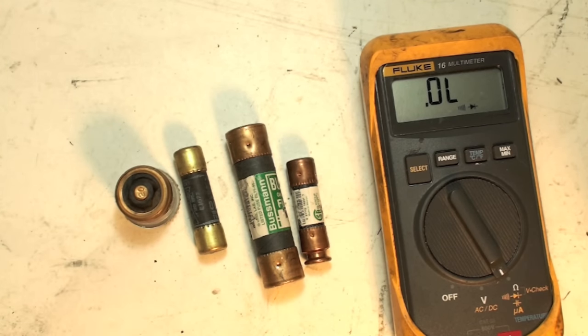You can get a meter for three or four bucks. I'm not real thrilled with the cheap meters, but I do this professionally so it's more important that I have a good meter — I use them pretty hard. The leads can go bad on them, or the meter itself goes bad, and it could get you in all sorts of trouble. But if you're just trying to find out what's wrong with your equipment, you can pull those fuses out and check them with a cheap ohmmeter. And that is checking the fuses.